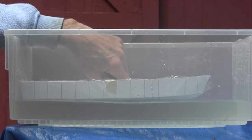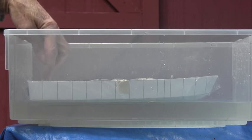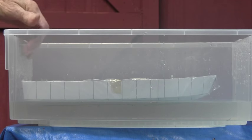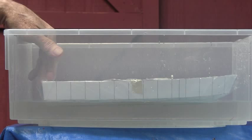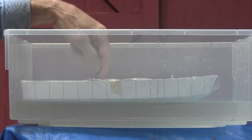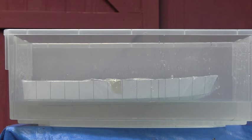You can stick a side seat in, put a third person in, and move that guy up a little — the boat's big enough for all kinds of seating arrangements. I'll have a false bulkhead just ahead of the transom to carry loads and keep from being pooped if you stop suddenly, some gussets between the two to absorb stresses from the outboard on the hull, then box seats on each side with a pedestal, and box seats in the middle with a raised platform. You can hide the fuel tank underneath and probably a seat up front with maybe a small deck and hatch for buoys.